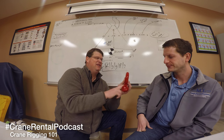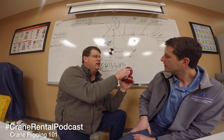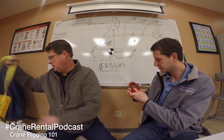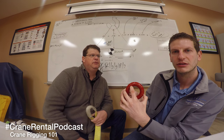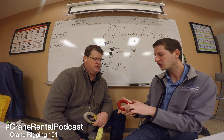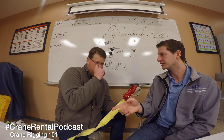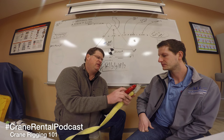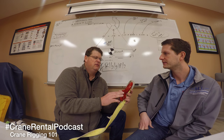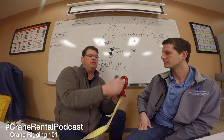That's generally what happened - we backed it off and then did some at-capacity picks or we did it kind of crooked or sideways. You'll notice on the shackle it tells you where the load should be applied. All your standard manufacturing numbers and labels - this is a six and a half ton shackle. You have your 45-degree marks and you have to have all those markings on here for this to be legal. The stamp has to be raised or embossed, much like the tags on slings.